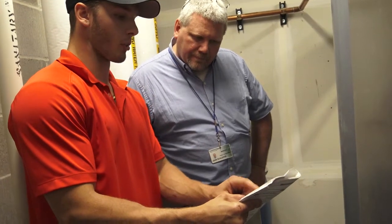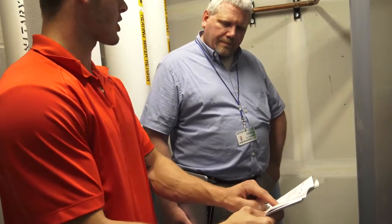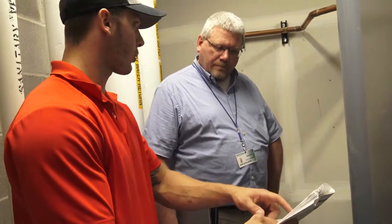These are your CO2 numbers and these are your O2 numbers. Gotcha. You want to really match CO2. Okay. That's what you want to try to stick to. Your oxygen levels kind of fluctuate a little bit more. Sure. So right there. And it tells you propane, it tells you how to turn it. They have arrows on the gas valve adjustments for that, but it'll even tell you to increase CO2, turn it a quarter turn counterclockwise, you know? So it's spelled out in there.